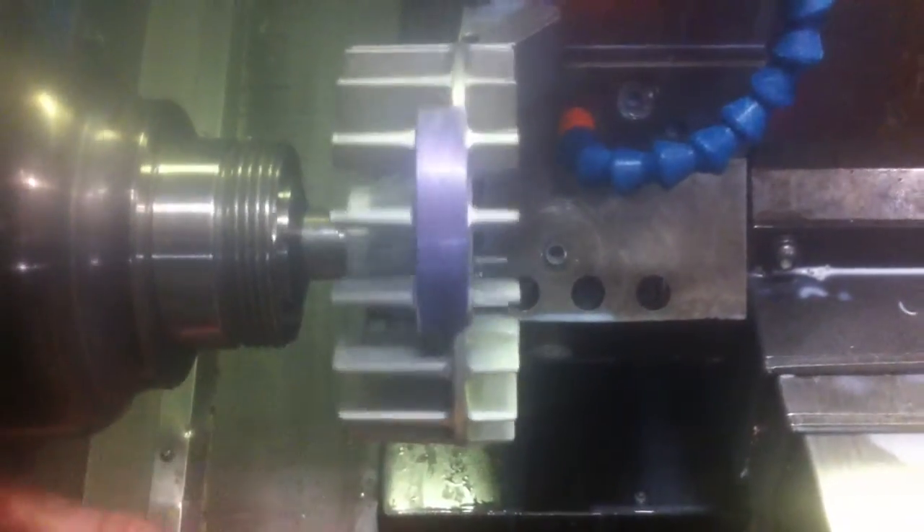The air gap is fine. So what I do is program it to turn it, and that'll pretty much make it straight. See — no line there, come back around, line the whole time. It's oblong at the magnet — that's your high spot. That's why it only binds up there and that's where you set your air gap. Since I've got this set up I might as well program it to get them done for you. I'll mic the diameter and take 15 or 20 thou off like the other one.